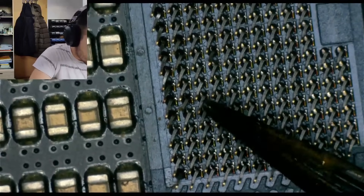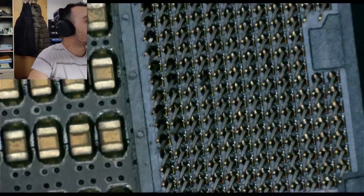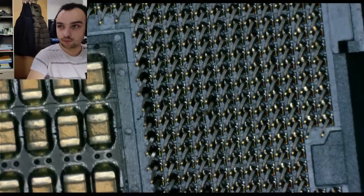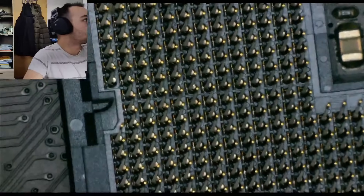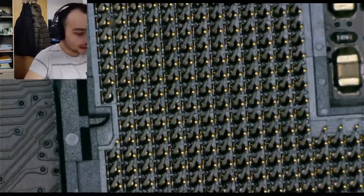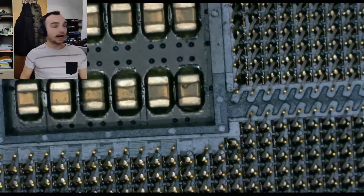The biggest problem, especially when you have to do this a lot, is being very careful that pins don't short together against different ones. For now I want us to go into a board view and look at some of these legs to see what they are responsible for. The socket layout is universal for the same chipset type, so taking any Z490 board view will show us what these pins are responsible for — especially the two that are broken.